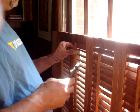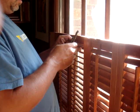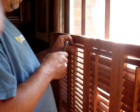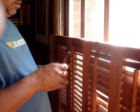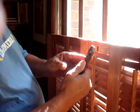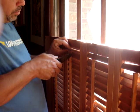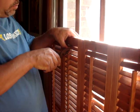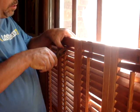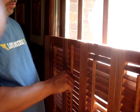Then all you really need is a pair of pliers. Now this is where most people get in trouble — though actually this is a little bit easier fix because the staple has come out of the louver. So you just get a pair of pliers, hold a corner of that staple, make sure you thread it through the staple on the accompanying tilt bar, and just push it in firmly until it sticks out about as even as all the other ones. And it's just that simple.